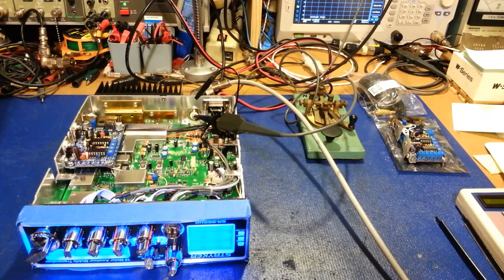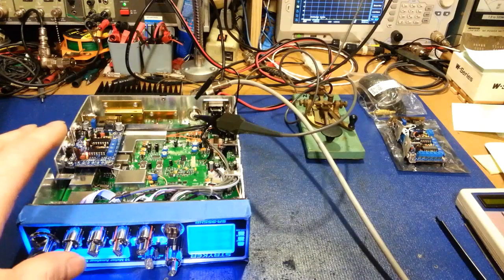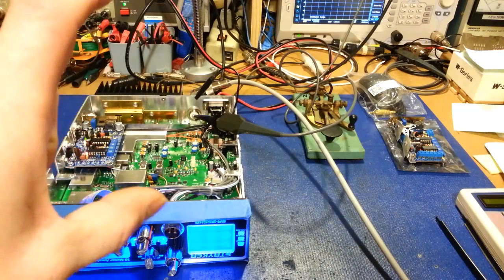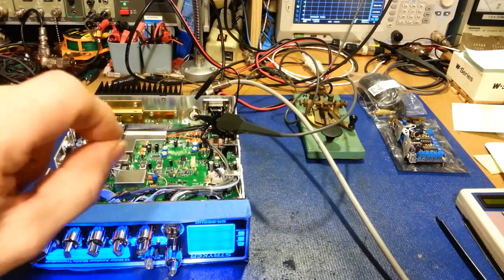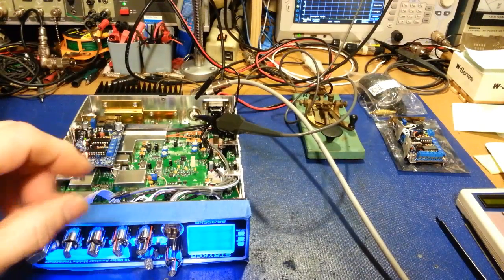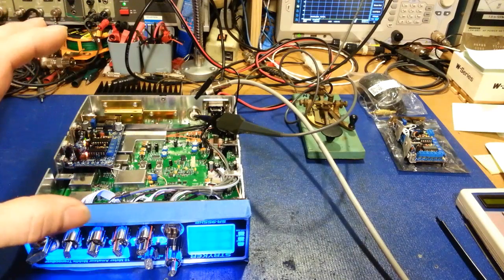Now, you don't want to increase your negatives, because once you get down to zero in the waveform, which you'll see here momentarily when you're looking at your modulation envelope on an oscilloscope, it goes up and it comes back down. And ideally, you just want it to kiss in the middle, just barely touch in the middle, and then come back up. So your positive peaks are at the top and bottom here, and then it pinches off to zero. You would never want to stay at zero, because zero is basically nothing. It's exactly that. It's nothing. But the idea behind these boards is to increase your positive peaks.